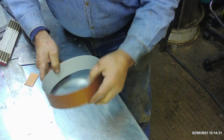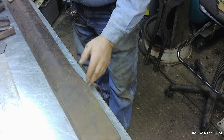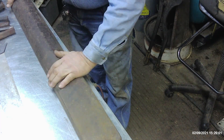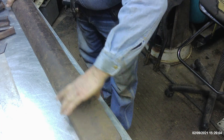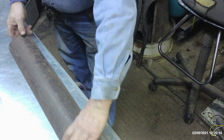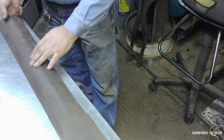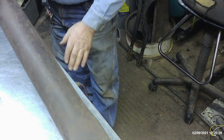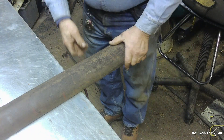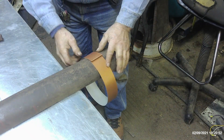This should come very close to eight inches when we're done. Now when people talk about anvils everybody always pictures a blacksmith anvil — nobody ever thinks about a tinner's anvil. But take a look here: this is a square chunk, a pretty solid heavy piece of metal. For about 12 inches it's square-shaped with a nice big flat work table, and the remaining 24 to 26 inches you've got a half-moon round shape — that is for shaping round pipe. Old timers years ago made their own flue pipes, round pipes, and adapters using the Adams Manufacturing Company anvil like this. So when you've got your anvil set on the bench you have to think about that joint we're making and how we're going to use it.